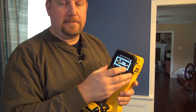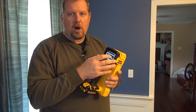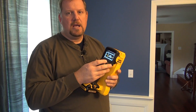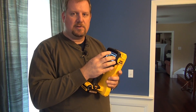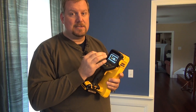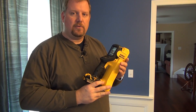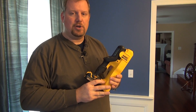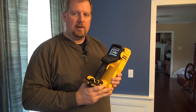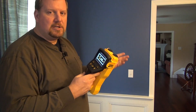It's going to have a little image of a wood stud. It's going to tell you whether or not you're at a wire, conduit, pipes, et cetera. It's very visual and very easy to read, and it actually gives you graphically the center of these things — so very accurate and very useful for renovation. Let's take a look. I'm going to show you how we do a pre-scan and what the screen looks like as we scan this wall, and I'll explain some things. This is my home, so I know what's in this wall, and it's pretty darn accurate.